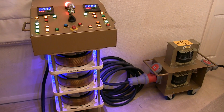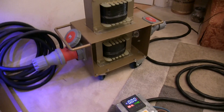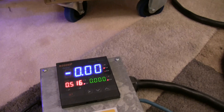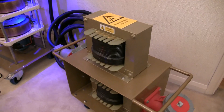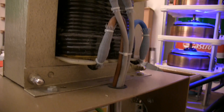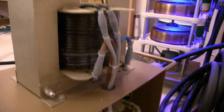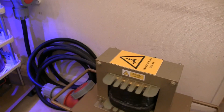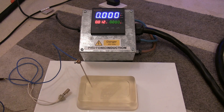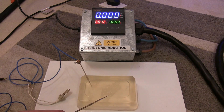100 amps available, but we don't quite need 100 amps — we've got the voltage we need. So let's crank this thing up and see at what point the ballistic gel begins to break down. I've got a small LED lamp rated at 12 volts — 12 volts on the screen in red as you can see — and the lamp comes on at full brightness. When we put it through this gel there is a resistance so it's a lot dimmer, which would indicate there is less current.